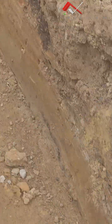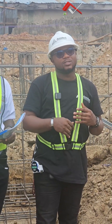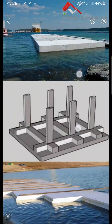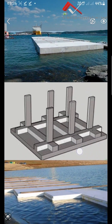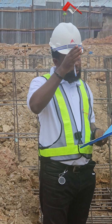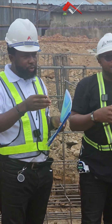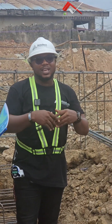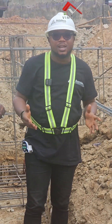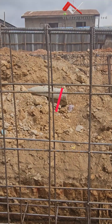That raft is actually a shallow foundation, not a deep foundation. It's a foundation system designed in such a way that the building is floating — the building is going to float on the soil, like a boat in the sea. Sometimes you see people doing a single raft; you have a single one, an inverted one. We have mats, which is called slab raft, in which the entire perimeter of the building is a slab and the raft beams are placed on the slab. So which one are we doing here? We are doing an inverted T raft — you can also see it behind us.